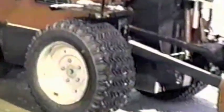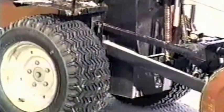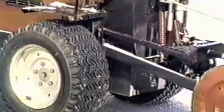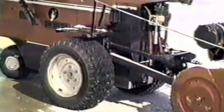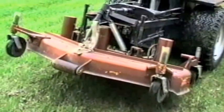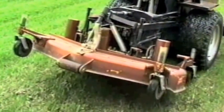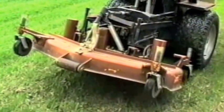The 12-inch wheels are driven by planetary drives from aircraft starters. Cone-to-dish friction drives form the transmission and allow a top speed of 5 miles an hour. The three-point hitch is made of tubing and flat iron. Linear actuators, like those used to open and close bay doors on aircraft, lift and tilt the lawn mower.